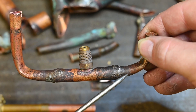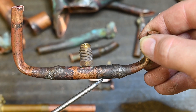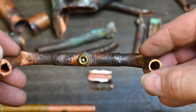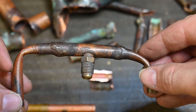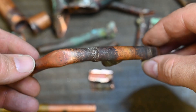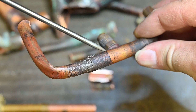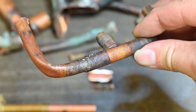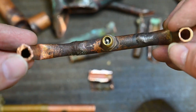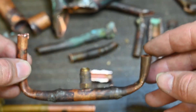This one is done really nice. The braze is smooth all the way on the edge, and more importantly we can see it's pulled all the way in — pulled in very deep inside the joint. We don't need to cut this one open because we can already tell it's in really good shape. On the other side as well, see how smooth it is? That's just the entrance and signature. The true braze is pulled in deep into the joint — that's what we want. It's a good solid braze. I can tell there's a little bit of overheating on it, but not bad. These kinks on the sides are another story — a whole other issue.